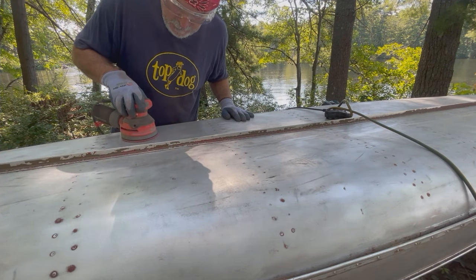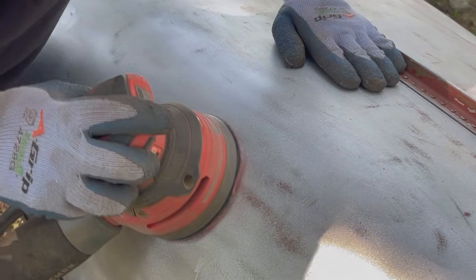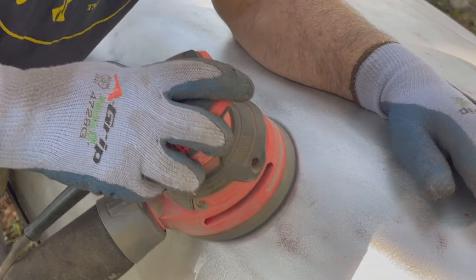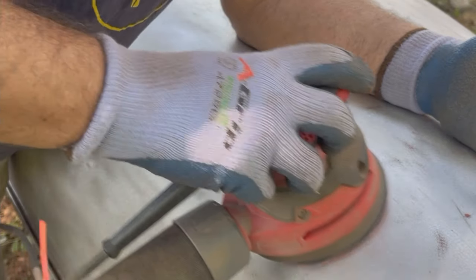By far the most important part of removing old paint coats with an orbital sander is the grit on the disc pads. I started with 120 grit, which was too light and made the process really slow for the first few hours. Then my daughter suggested I try a much heavier grit. The 65 grit did the trick on all the hard spots, then I went over again to smooth it out with the 120. That made the job go much smoother and it looked better too.